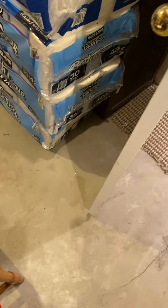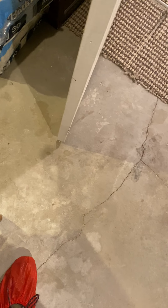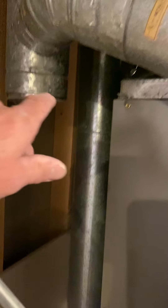Then we'll pan up the wall and take a 36 by 6 tall duct and tap it onto the back of the return air, running it around behind the furnace. Cut in the grill as high as you can — this is return air up high, not in the basement, to get more return air as per scope.